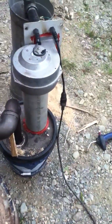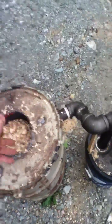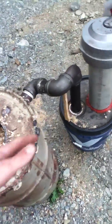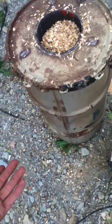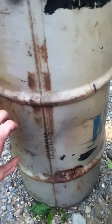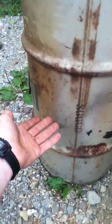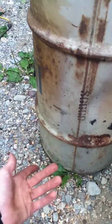This is my wood gas fire — no matter how crude and simple. The fuel is simple wood sawdust, and it burns quite fast. This is a stratified wood downdraft gasifier. The first section is the drying zone, where burning and oxygen are present. It basically turns the wood chips into charcoal. The next layer, the charcoal is vaporized into gas and smoke.